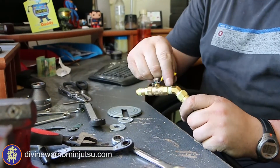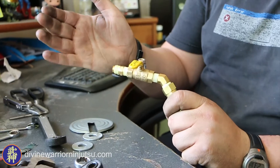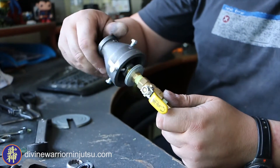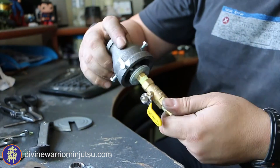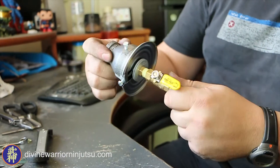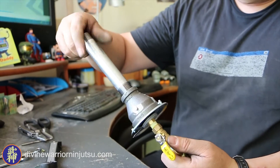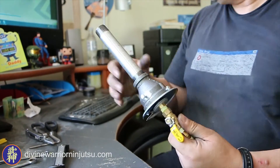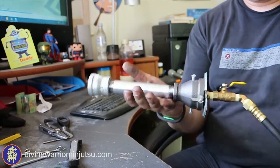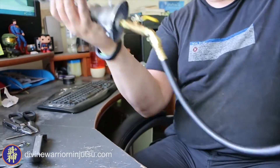Okay, we turned these around — now that's on, that's off. Not very safe particularly, but not too bad. Two half-cut washers go on next, then your nozzle, hand tight. You do need room for your makeshift airflow regulator. Then the next thing you're going to do is take your pipe — here's your nozzle, the pipe goes in here — and then your flare at the end goes on here. Now it is completely done. Your nozzle is done.